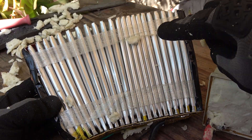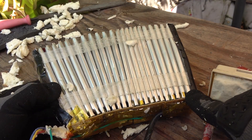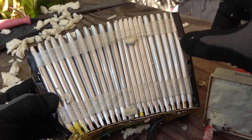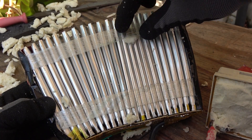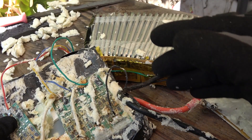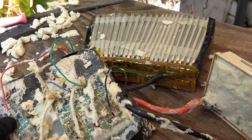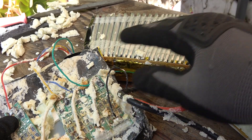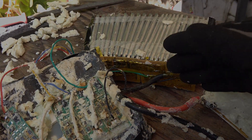There are actually 24 cells in here, so each group is 6P — making this a 4S6P configuration. Almost all of them are swollen except one group which is totally intact; the rest look like pufferfish. So there you have it — that's why you need a BMS for a lithium iron phosphate battery pack. A balancer is nice to have and it will help balance out the battery, but that's not enough. Thanks for watching.